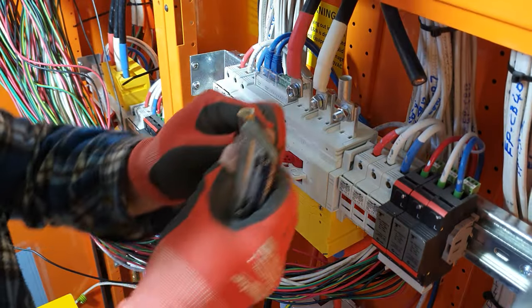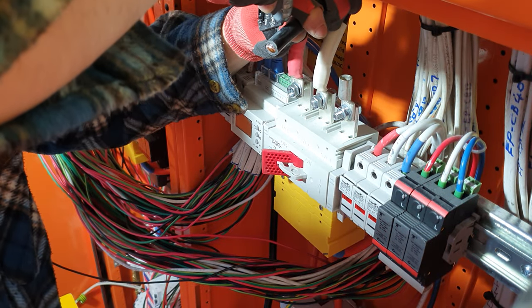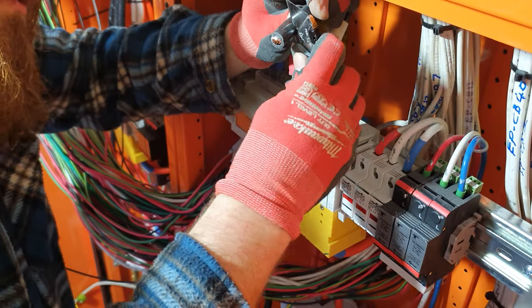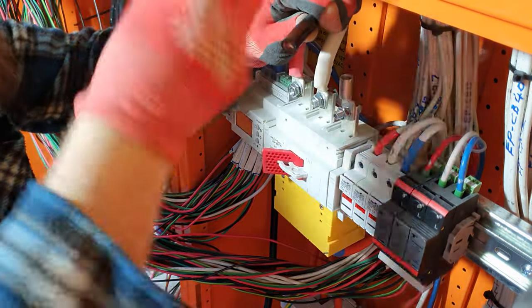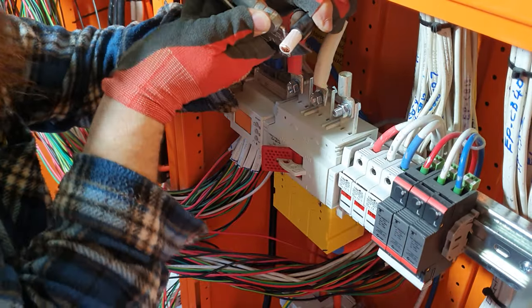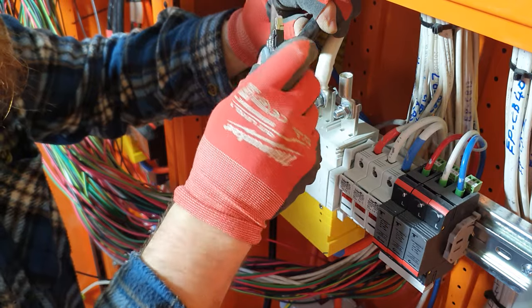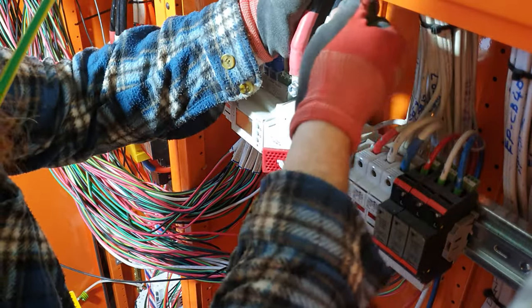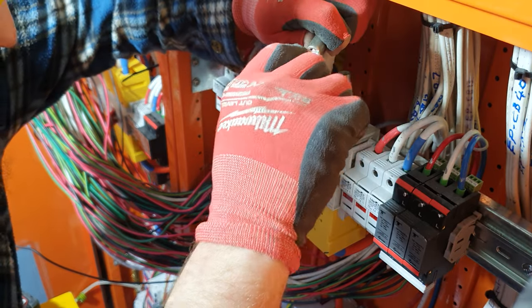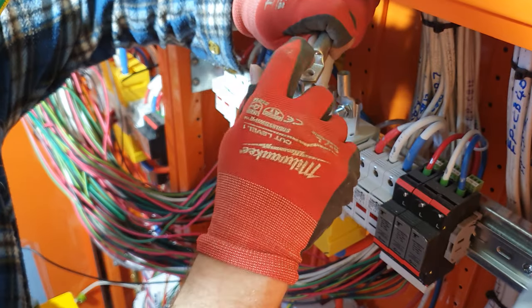We need a lug to get your depth, so you need a lug to get your depth measurement. Let's just make a little mark. It's a little awkward because this board is so — we're just going to ring around the cable as square as we can, get that other sheath off. Then we'll lug this cable. What you're aiming for — as you can see here, we've got copper touching that point and it's nice and tight. That's the perfect length.